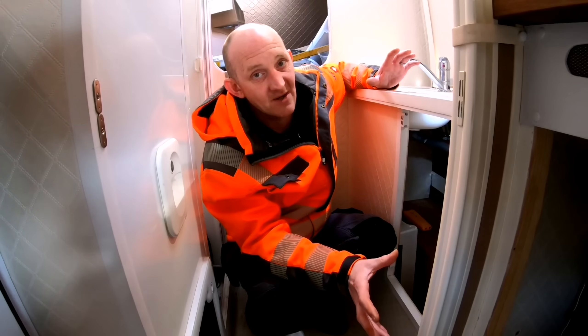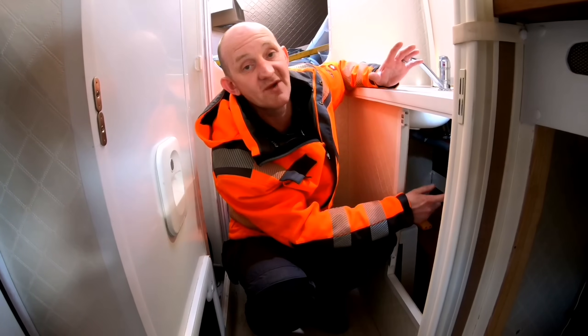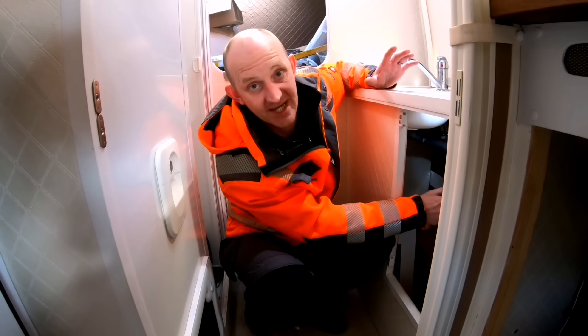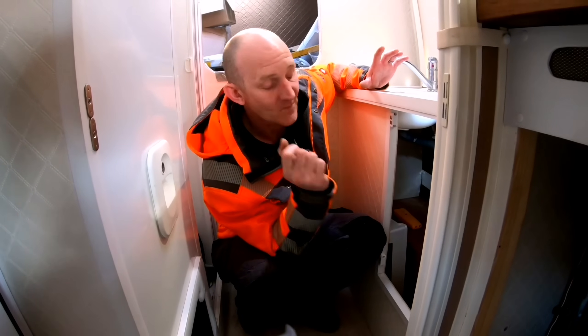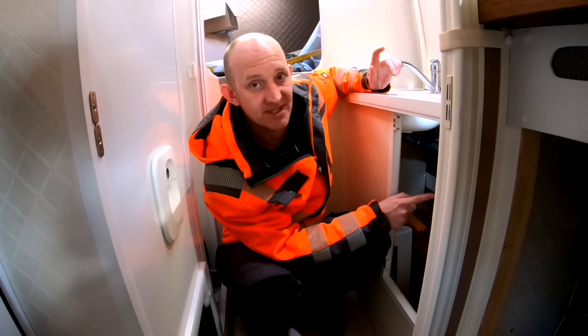One of the main reasons we say this now is that, as simple as it was, we found out just by pressing the test button on the RCD that we actually found a fault with Mark's inverter — and it wouldn't have tripped the RCD otherwise.